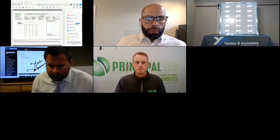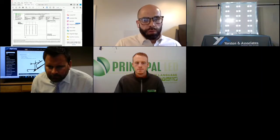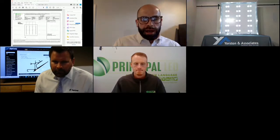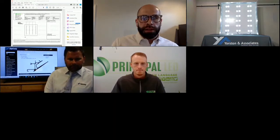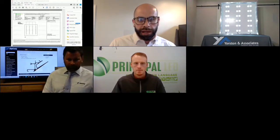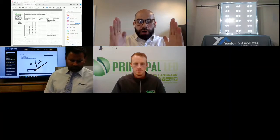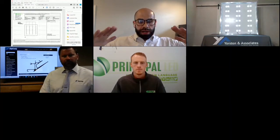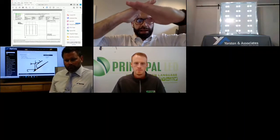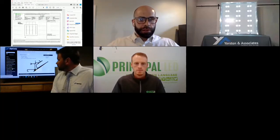So real quick, I'm focused on Lauren's screen right now. You see we've got four rows of product, roughly at a 12-inch on center spacing. And if you click on Ellen's screen, you'll see that we've got six rows that are pretty much side by side. So what we're doing is getting that LED far enough away from that frame brace, so there's air space for those beams to intersect, to blend, and to hit the face, and to be evenly illuminated.